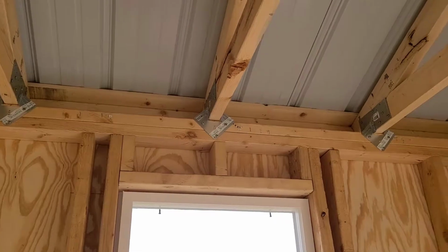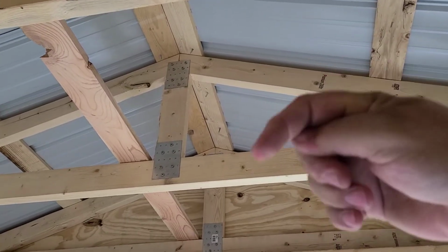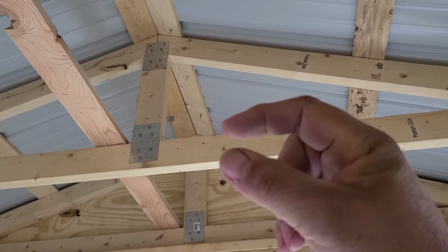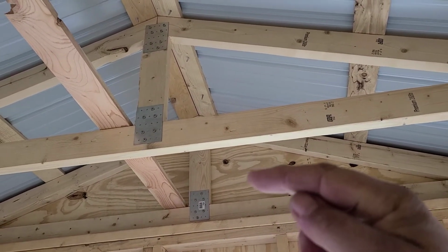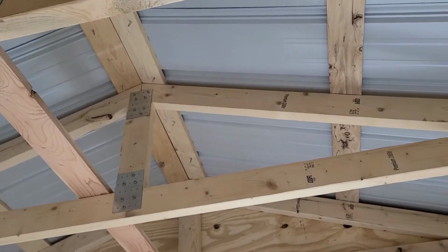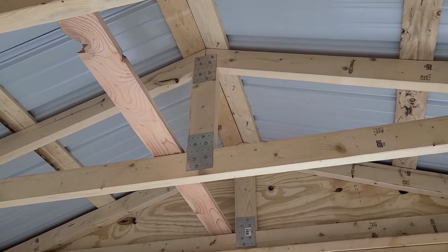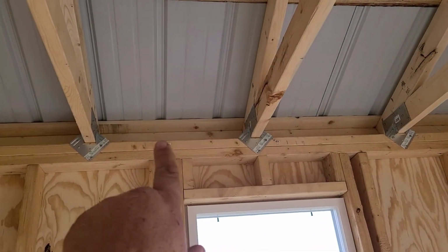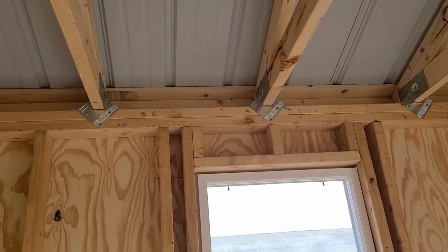Now they make an outside closure, which is used up top. It goes on top of the roof to go between your metal roof and the ridge cap. So instead of having humps in it, it's actually got cutouts in it to go over the top of those ridges. It's just the opposite. They have sticky on one side, so they'll actually stick down to the roof, whereas your inside closures actually stick down to the wood, and you put those up as you go along putting the sheets.